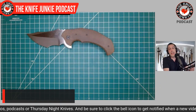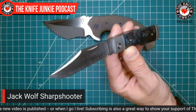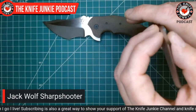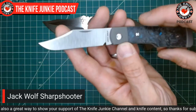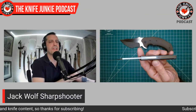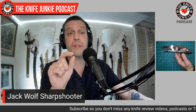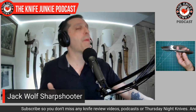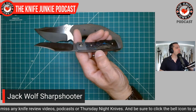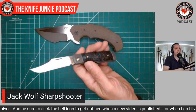Next up is the Jack Wolf Knives Sharpshooter. This is the knife I used today — I used it to cut an apple at work, but it was a pleasure to cut with. It's so thin and hollow ground, high all the way up to the spine. That's M390 blade steel on an integral titanium frame. When we're talking slip joints, we're not saying it's the same thing as an integral modern locking folder. This just means the bolsters and liners are one solid piece of titanium out of which a pocket was milled that the covers rest in, as opposed to the bolsters being soldered onto the liners, which is the more traditional way of manufacturing a slip joint.